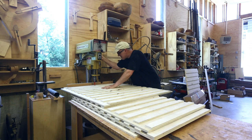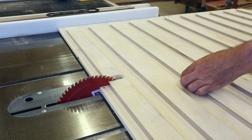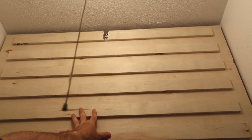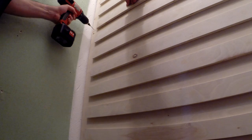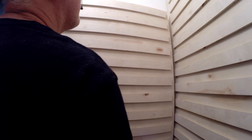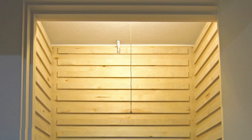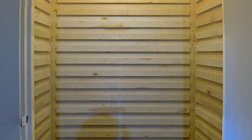On the top of the upper panel, there are some wires that come out of the wall and go into the ceiling, so I had to cut a little notch in the top of the upper panel. You can see how that fits into the panel. I really don't know what those wires go to, so I didn't want to cut them. Then the side panels can go in — same thing, a screw at each corner. That's what the closet with the panel system looks like without any storage systems hanging on the cleats yet.